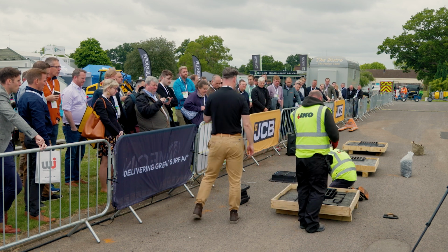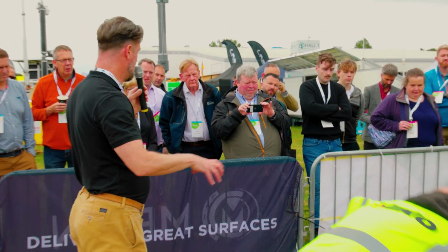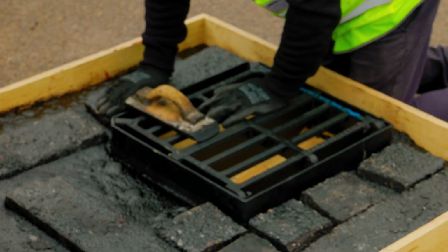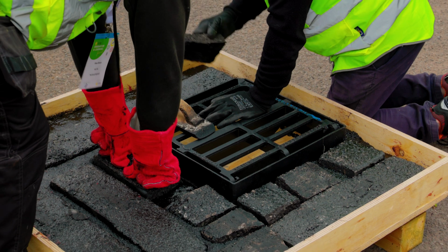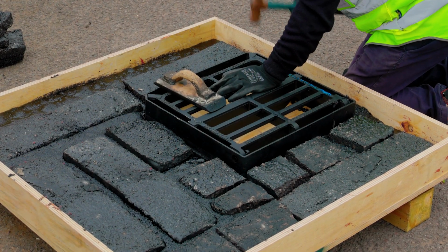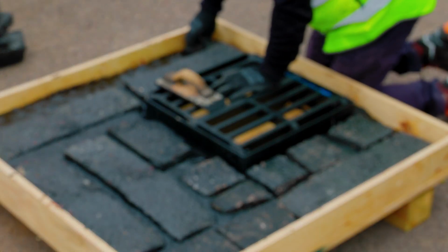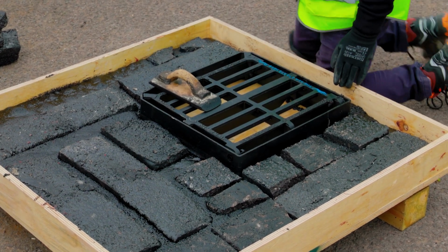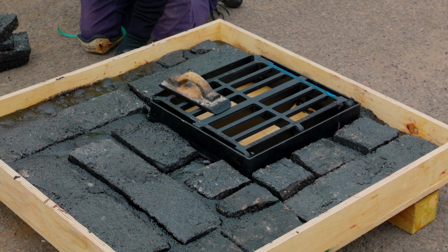The contractors on site, the experienced ones, as we've done here, get their bricks ready round the rebate to go. Sometimes when we're doing the training, some of the contractors are still going backwards and forwards from the truck to get the brick. But the experienced ones will line it all up, just get it like a jigsaw, and plan out where it's going to go. So it just speeds the process up still further. So as you can see, broken little bits off, just embedding those in to finish off this one, and then we'll move on to that one.